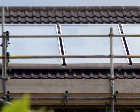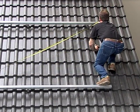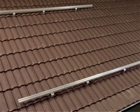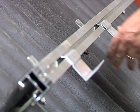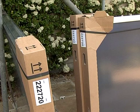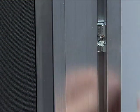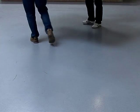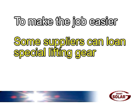Although two or three panels are the norm, up to five panels can be connected in series if required. The upper anchors and rail are fixed in the same way and diagonally measured against the lower rails to confirm that both rails are correctly positioned relative to each other. With the upper and lower mounting rails fixed, it's time to fix the collectors. On the lower rail, support plates are now inserted to support the collector before fixing. Each collector measures about 1 by 2 metres and weighs 44 kilograms. They're supplied in protective packaging, although the glass can support the weight of 10 men. Aluminium lifting handles can be provided and are quickly attached to the panel with the fixing supplied. While two men can easily handle the collectors, it's recommended to use pulley systems or a small winch attached to the scaffolding to lift the panel to the roof. Some suppliers can loan special lifting gear.